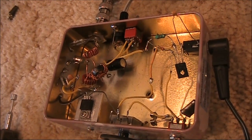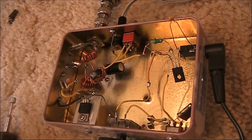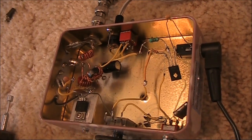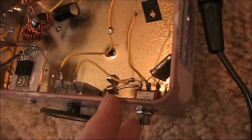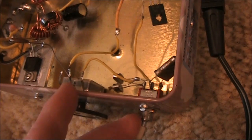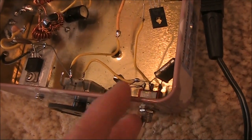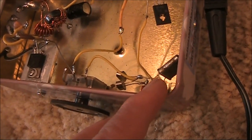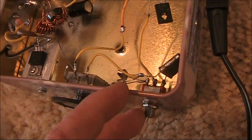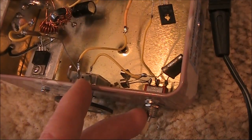It uses a BD139, which you can see on the right. On the left is a low-pass filter. At the bottom left is an IRF510, not used in this circuit but it will be used later on. I've also added a variable capacitor in series with the crystal to provide some frequency agility, and a switch so I can switch between two crystals. I've got one crystal for 7015, and two crystals in parallel on 7023. The benefit of the parallel crystals is to give greater pulling range with the variable capacitor.